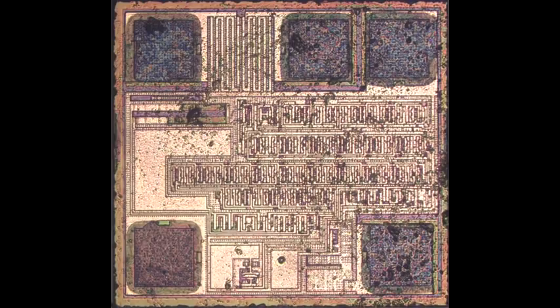What we're looking at is five bond pads. We can identify two FET structures as highlighted. The FETs are driving some sort of high current — which would be the LEDs — so that implies those two highlighted pads are the LED driver outputs, one for each color. There are two pads on the diagonal; they both connect to metal running right across from them, a good sign those are the power and ground pads. That would leave the pad on the lower right as the input which actually controls the oscillation.